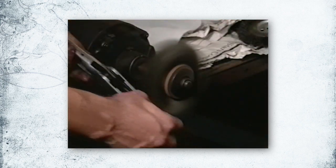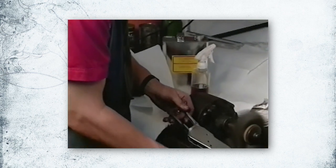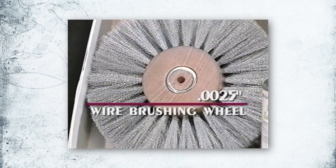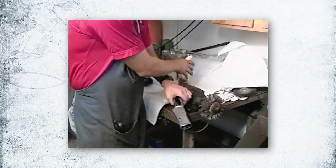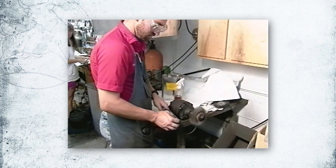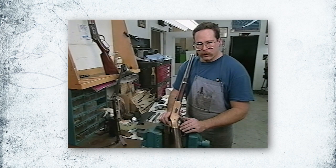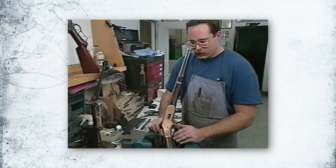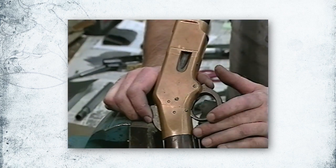This will give a good mirror-bright finish without any danger to the screw holes or edges. Another way to apply the final polish is with a wire brushing wheel. Be sure to wear eye protection when operating any motorized tool. Most hardware store wire wheels are too coarse — use a two-and-a-half thousandths wire brushing wheel, available from Brownells. For parts you want a matte finish on, apply a light coat of oil to the part before polishing — an oiled wheel polishes to a matte finish. Any errors you've made before this step will become more noticeable now. As a general rule, avoid polishing brass parts or brass guns, because the patina — the aged color of the brass — is extremely important to the value of the gun, and polishing will remove it.